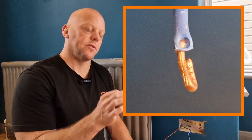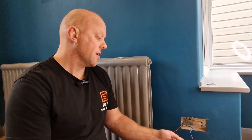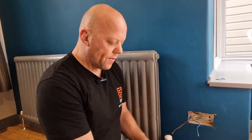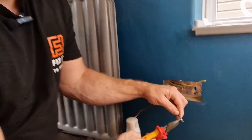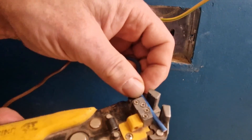As you can see on screen, when the last socket was fitted it was tightened and the screw actually penetrated the insulation rather than touching the copper. In the long term this can create something called a high resistance joint, which creates heat — and that's something we don't want. So I'm going to show you how to fix that really simply. To strip the cable you can either use some normal side cutters or some cable strippers. The first thing we need to do is cut that damaged section off and then strip the end.